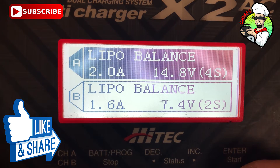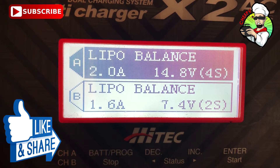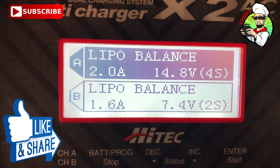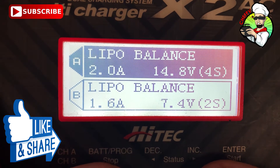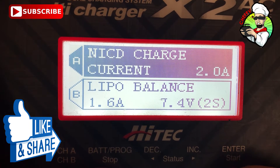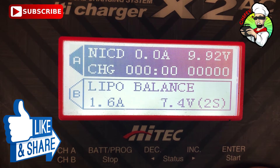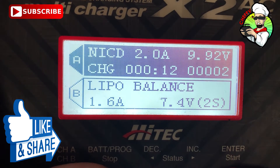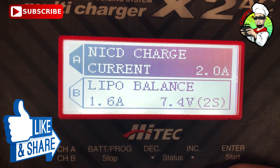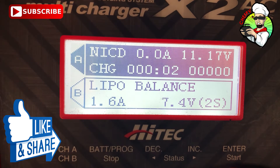I'm basically trying to boost it to the right voltage to allow my charger to safely charge it. It has a connection break because I forgot to put the balance port in. Connection break — it still doesn't think it's the right size battery. So we're going to back out, go to NiCad, pull the balance port. 9.92 — we're getting there. We have to get it to about 10.5 to 11 volts before it will read on my charger. NiCad batteries do not charge with a constant balance, so it's not constantly reading — it does one check. See, 11.17 — it did one check.